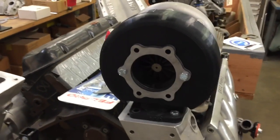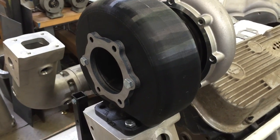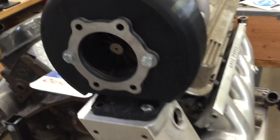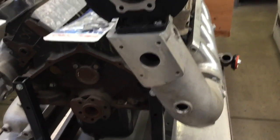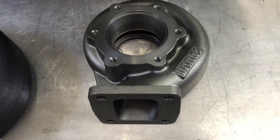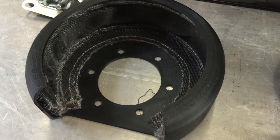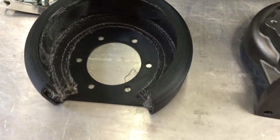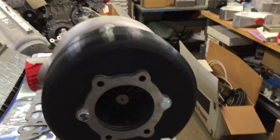On the back, this black printed item you see here is the heat shield housing. It will be either brushed or polished stainless, depending on whether you polish the compressor. The risers — what we call exhaust risers — can accommodate wastegates. Here's our new turbine housing, which is also on-center. Inside that heat shield there's a heat blanket with half-inch ceramic encased in a basalt outer, retained inside with a large stainless snap ring. All of this will be a lot prettier once that stainless is polished up.